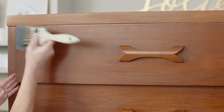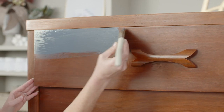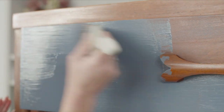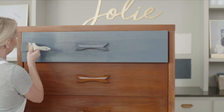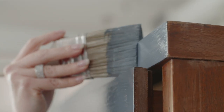Using your flat brush, lightly apply a thin, even coat of paint. Hold the brush at a slight angle and use long, smooth brush strokes in the direction of the woodgrain. While the paint is still wet, paint with continuous, even strokes from end to end to avoid start and stop brush marks. Allow the paint to dry — this usually takes about 20 minutes.